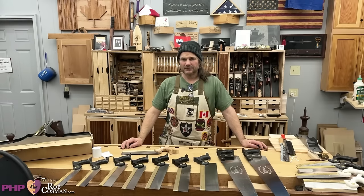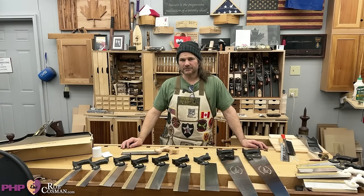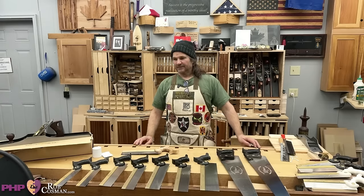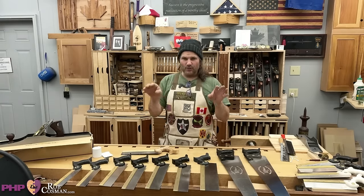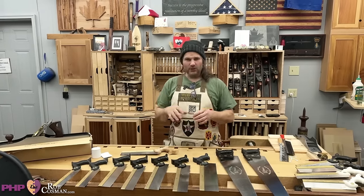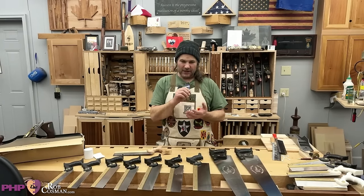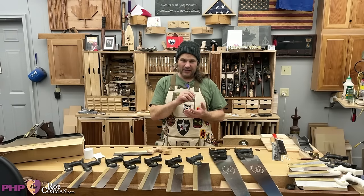Well, if you're talking about a relatively large piece of wood, a board, they measure in grams. $13 at the hardware store. Digital scale, weigh your board. A couple days later, weigh it again and record it. And just keep watching, because it'll eventually stop gaining or losing.